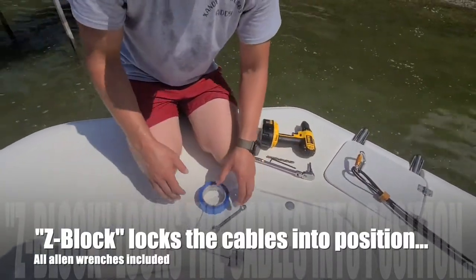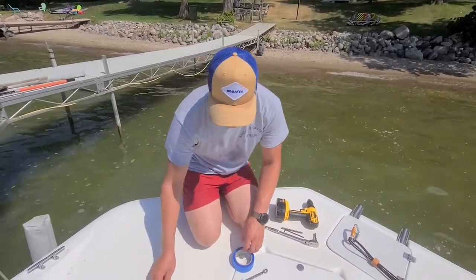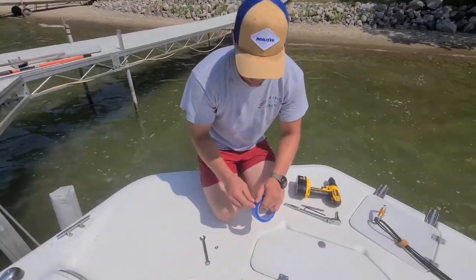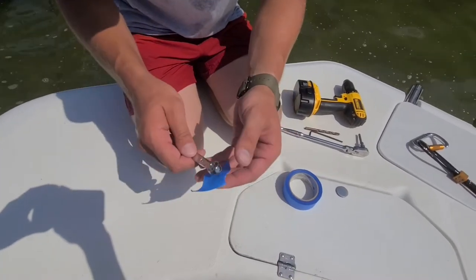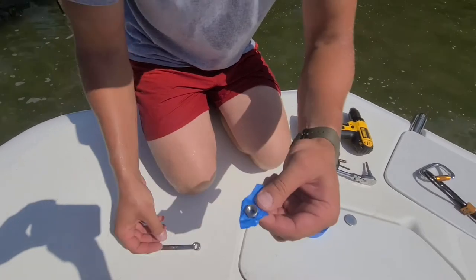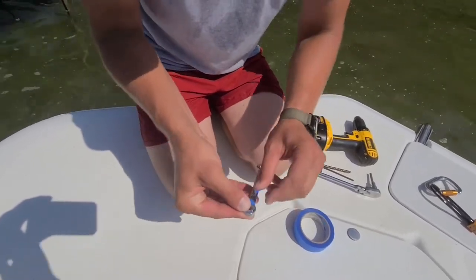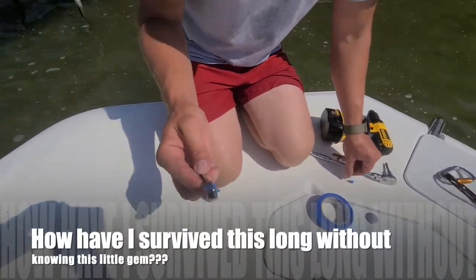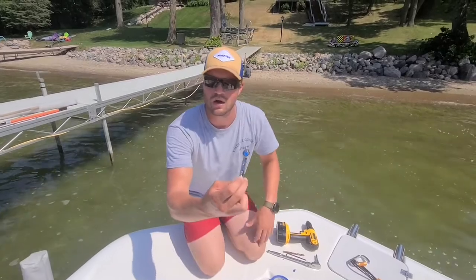Some people might find it hard to get into really tight or hard-to-reach spots — a blind hole where you can't see what you're trying to get to. A way I was taught many years ago in a shop is how to make a nut fit into your wrench a little bit easier so you can hold it without using your finger. Take some tape — even a shop towel or paper towel will work — press it and put your tape over the back of the nut, on the nylock side. Put your nut in like this, push it down into your wrench, and peel off the excess. Now you have a nut that will not fall out.